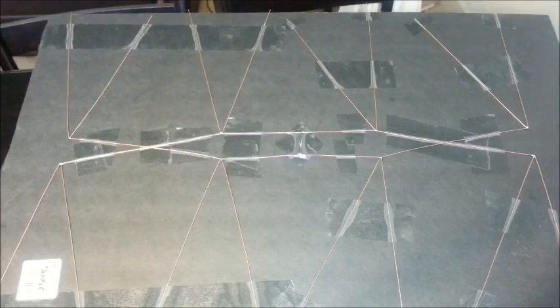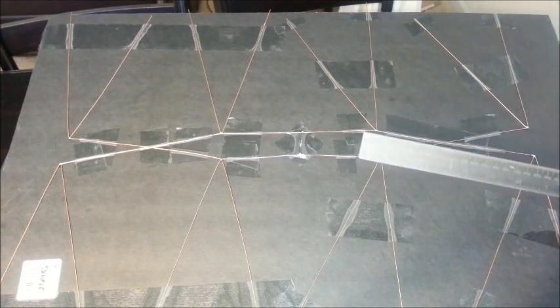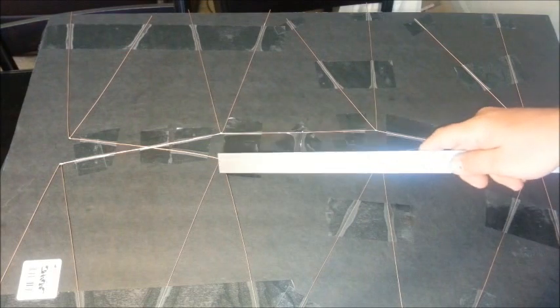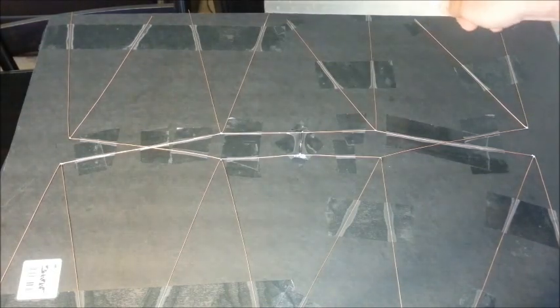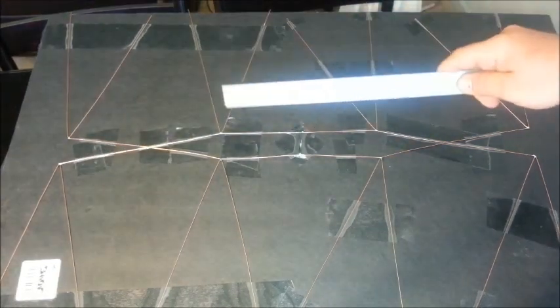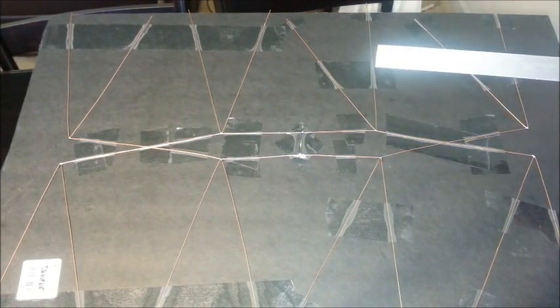Now that you have all that, we can start building this great antenna. The first thing you're going to do is take your eight 18-inch long pieces of wire and bend them in half so that you have two 9-inch legs, like so. You want to have a 30-degree bend right here — that comes out to be about 5 inches between the tips. You will want 8 of those. Then you have your two 24-inch pieces, and you're going to have a slight bend every 8 inches — that's about 10 degrees.